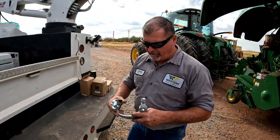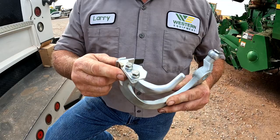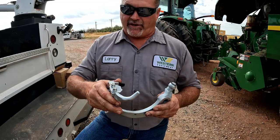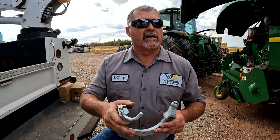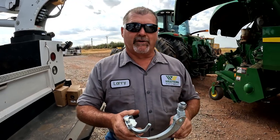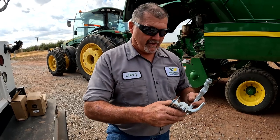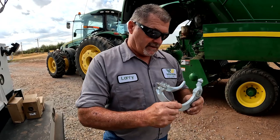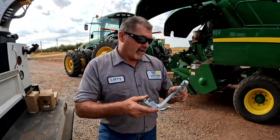We've made some adjustments on it in the past and haven't had much luck. What I've run into before on L340s and L341s is if the wiper arm is warped a little bit — I'll show you what that looks like. This is a wiper arm for an L340 or L341, and if this part gets warped at all it'll throw the wiper arm somewhat out of time and not wipe the knot off the bill hook. The result is a knot hung in the bill hook, and if you go long enough you get a warning on the display. We're going to install a new wiper arm today and make an adjustment as well.